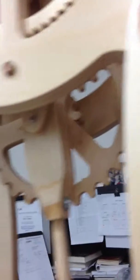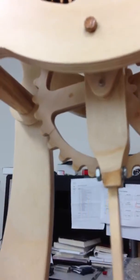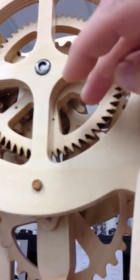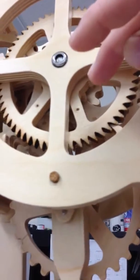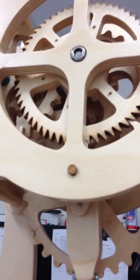That's your clutch right there. You're holding this steady and shifting it a little bit either toward left or right. If the finger is closer to the escapement wheel, then you move the clutch more toward that direction.